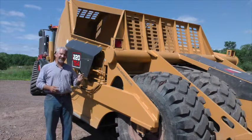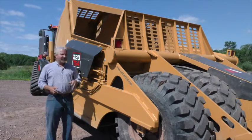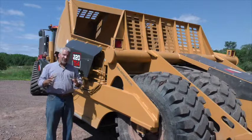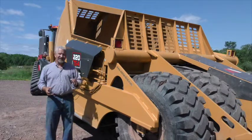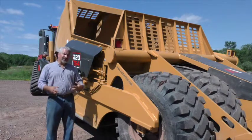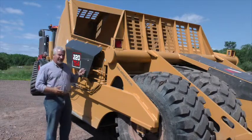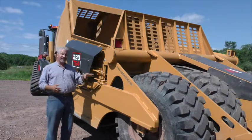On the back left-hand side we have the hydraulic control system — a mega flow valve system that handles 50 gallons a minute. When you plug into tractors with high-flow hydraulics, we've got to have a valve that handles that hydraulic flow. We use three-quarter-inch hydraulic line tubing coming into this valve system so we don't have any restrictions within the circuit. A lot of competition has smaller valve systems without adequate flow characteristics, causing higher pressure in the hydraulic circuit, a higher rate of heat buildup, and more prone leaks showing up in the cylinder glands.